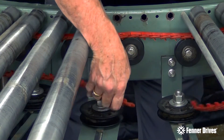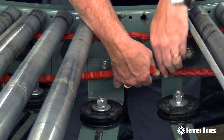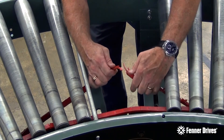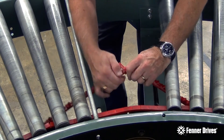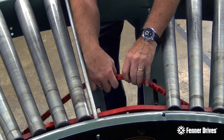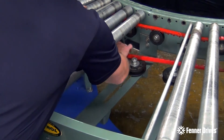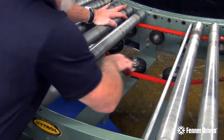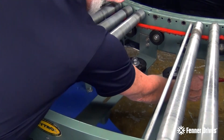Now, with the belt off of the take-up and with a little bit of slack, we're going to put the belt back together. To put it back together, we'll do just what we described in the beginning — insert this tab down through and hook that corner. We'll put it back together. So now we've got one link in, now we'll put the second link in and line that up — now the belt's back together. The nice thing about Power Twist Roller Drive is there will be enough give to the belt that now that we've pre-tensioned it, I can actually take the belt, stretch it over the take-ups, and put it on the take-up. You can see now that the tension we put on just by shortening it is enough to rotate your rollers — that's the right tension.